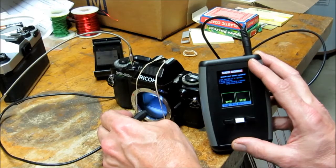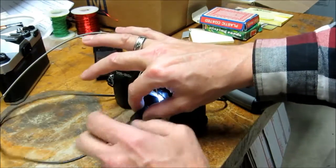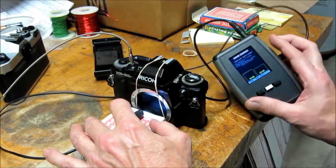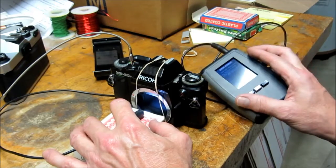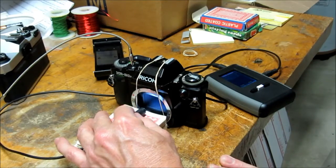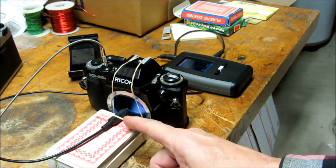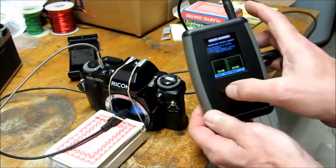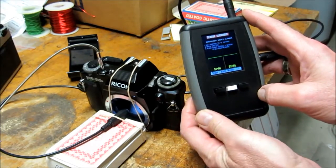Your goal is to try to get both bar graphs at about an equal level. One of the easiest ways to do that is to use a deck of cards underneath the light source to set it to the right height while you watch the bar graphs. You can add or subtract cards to get it to the right height. I've now used a rubber band to hold the light source to the deck of cards, and both signals are about equivalent — so I'm ready to test.